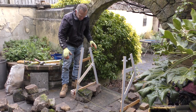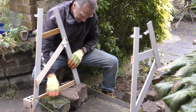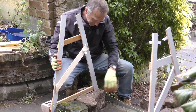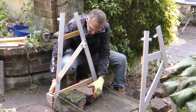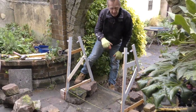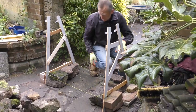I can't knock it in the ground because it's hard ground. So I've positioned two of the starter stones — quite big ones. For the ends, what we call the cheek ends, we've put a quite large piece which just needs pinning at the back to stop it rocking, and another one to give an idea of the base width. I've put my batter frame up against them with a couple of bits of wood just to make sure it's firm. The same on the other side — just squash that in there and the batter is set up.